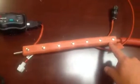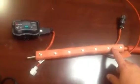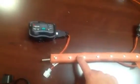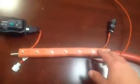What we have here is a way to maintain very uniform heat and control of a gas line from a gas cabinet to a tool. We've got one straight section — as long as you have one straight section, either one foot or two feet depending on whether you use 120 volts or 240 volts — this heater has not only the heating element in it, but also a sensor built in to allow us to control it. This controller monitors the sensor inside the heater and modulates the power on and off to maintain the heater at temperature — say 85 degrees C or up to 200 degrees C.